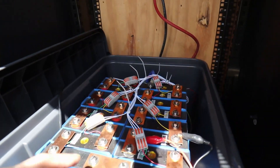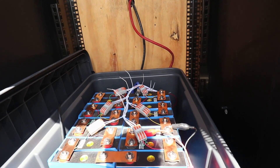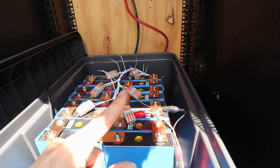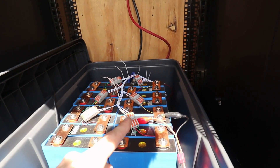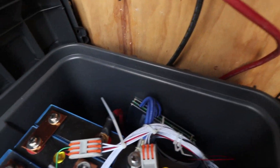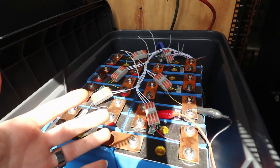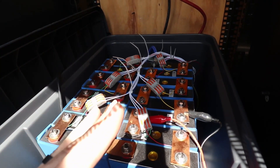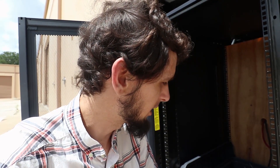What we've got here are 16 lithium iron phosphate cells at 100 amp hours apiece. I punched some custom bus bars — I've got a video about that on the channel — and these little connectors are just so that if I ever want to replace the BMS with a different type I don't have to re-solder or re-bolt everything; I can just pop the wires into a Wago connector and swap the sense leads out. Back here the BMS — which should be attached to something non-floating — is my Ant BMS that can do 16S. It's got under-temperature, over-temperature, under-voltage, and over-voltage control for the pack as well as for individual cells, and that's what keeps everything safe. The power actually runs through the BMS so it can handle about 140 amps continuous through its MOSFETs, whether charging or discharging, and it will cut the power from the negative side if any of those conditions are triggered.